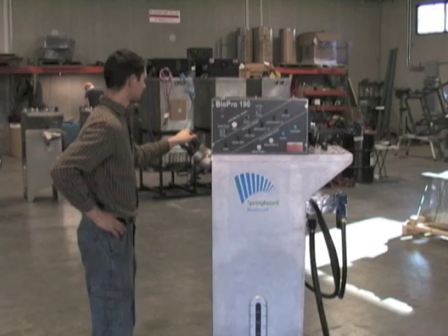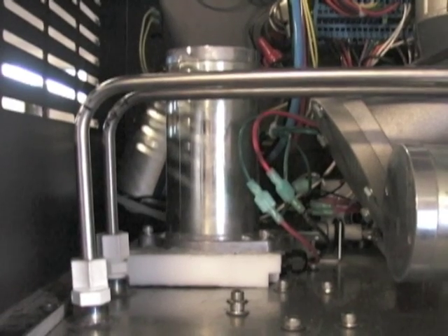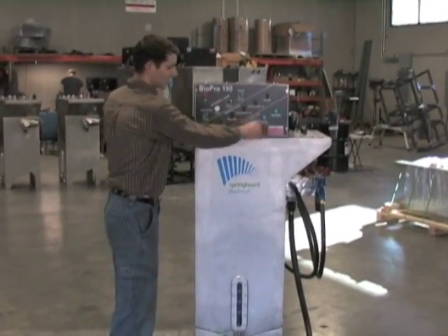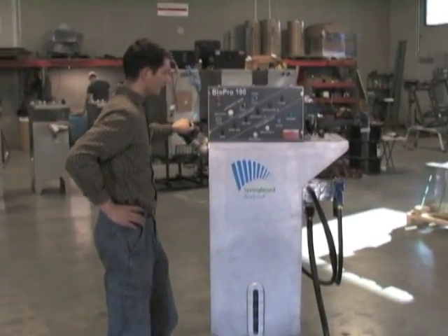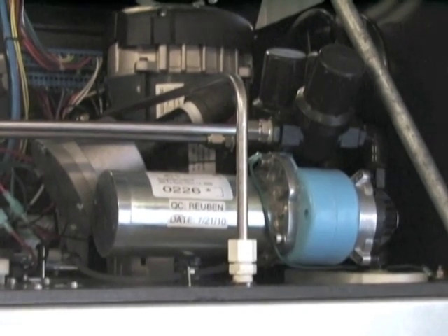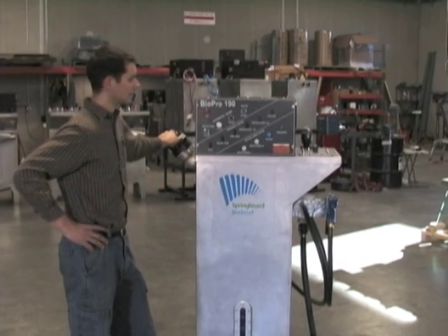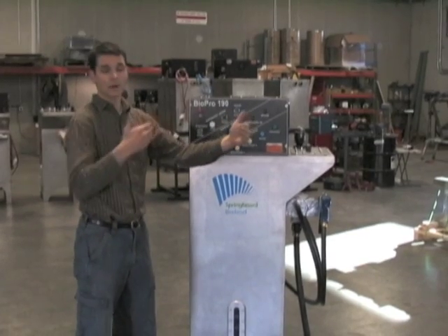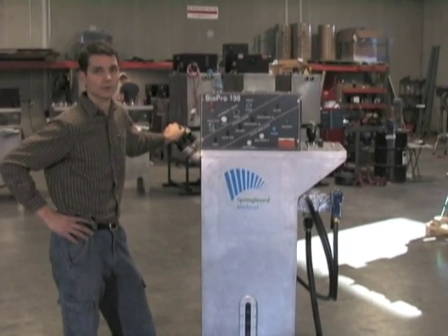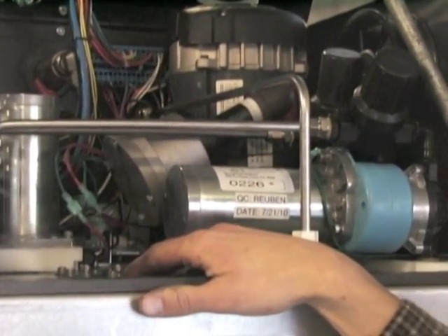Same type of setup for the methoxide mixing chamber — it's got an explosion-proof motor with a sealed face on it directly that stirs a prop that agitates the methoxide mixture. Also, the pumps that pump methanol and methoxide mixture are a unique custom setup that we designed here. It's an explosion-proof motor that remotely drives two diaphragm-style pump heads. The advantage of that is it keeps the liquid methanol, which is flammable, out of contact with the motor. Any plumbing that's carrying methanol or methoxide we make out of stainless steel, which ensures its durability and safety.